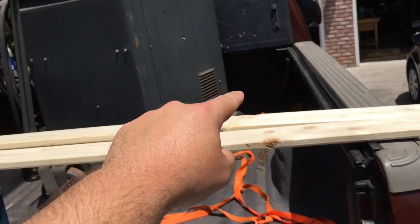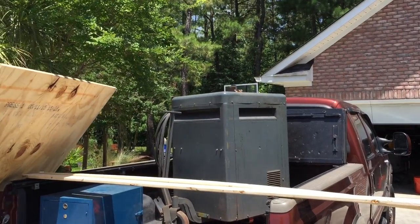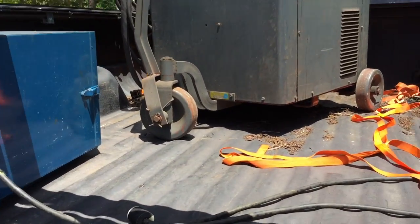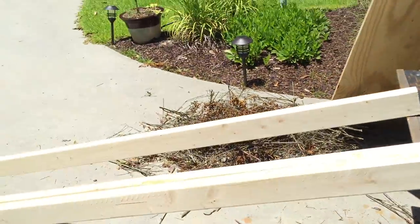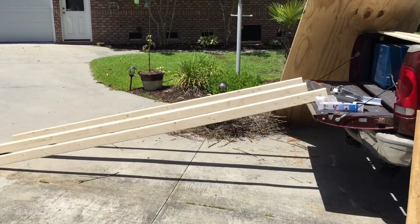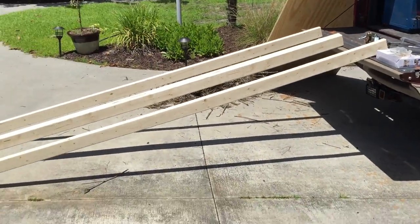I'm not gonna stand on this — I'm lowering it down. I'm basically going to lower it with a come-along. I've got two connection points on the bed of my truck, and I'm gonna use the come-along just to lower it down the ramp slowly. There's a big lug up at the top that's made for hoisting, and these wheels on the bottom — it's sitting on a little go-kart that it's bolted to. I'm gonna leave it on that and let it freewheel down the ramp.